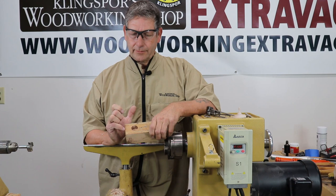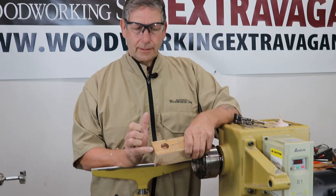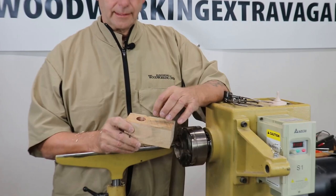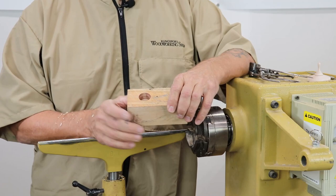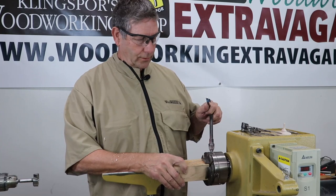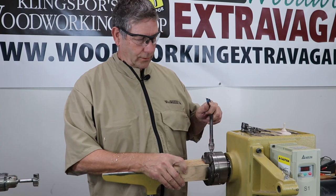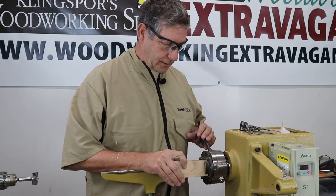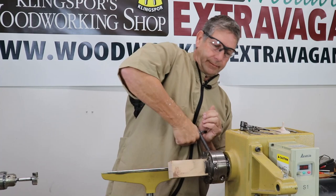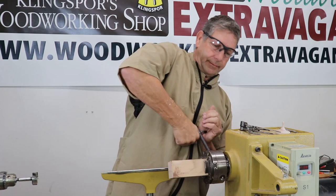From the top I drill a one-inch hole about an inch and a half down. From the top to the perch I drill an eighth-of-an-inch hole, and that's two and a half inches down. Those are easy numbers and they just look proportionally correct — that's how I came up with them. We're going to do this the same way as the top: I'm not going to put a tenon in it, just put it in the four corners of the chuck jaws, checking it's all evenly spaced — all by eye.